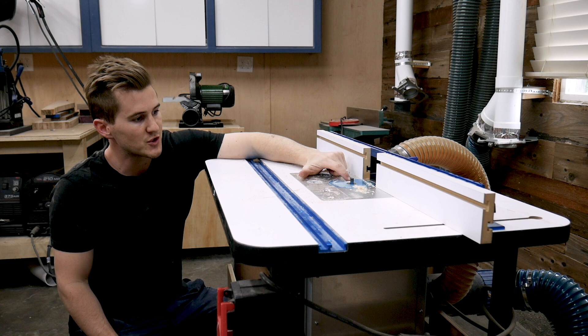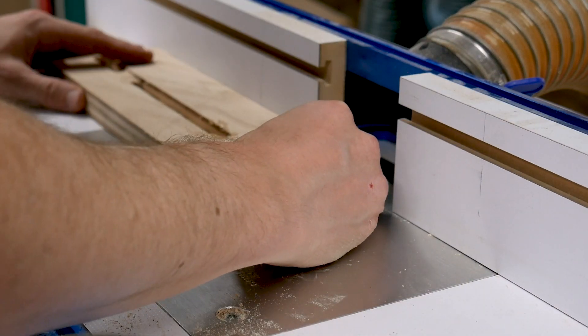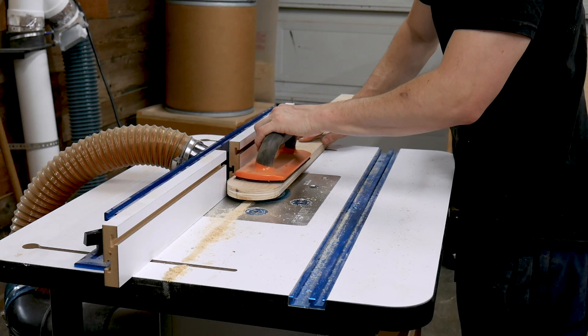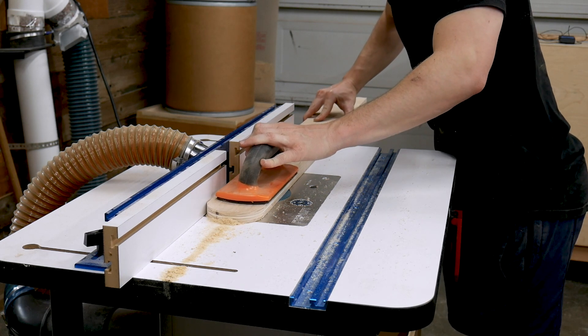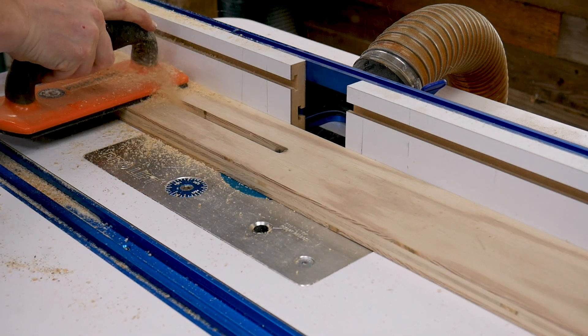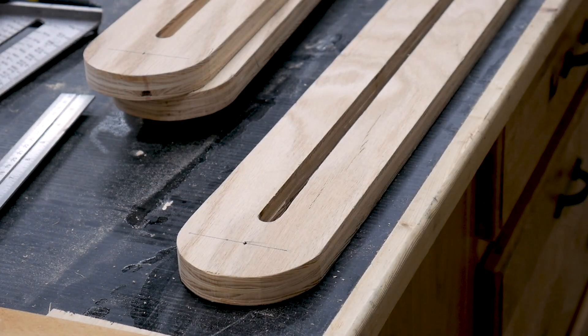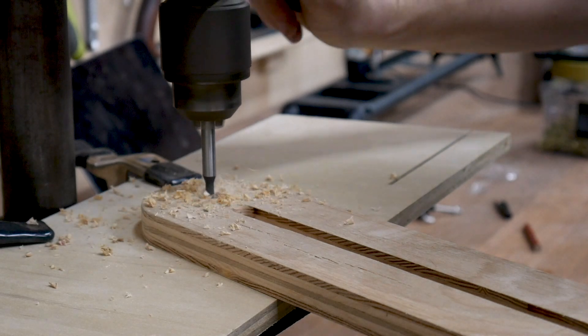What I did was put a half-inch straight bit in my router and raise the bit from the underside just slightly over half the height of the piece of plywood. I'll set up the fence so that when I run the piece along, it cuts a groove directly down the middle. Then I can flip it over and run the same groove, giving me a channel that allows screws to slide up and down. Instead of routing one side and flipping to avoid unevenness, I just routed the first grooves, then raised the bit up another half inch and routed them again — that worked out perfectly. The last thing is to add a couple of holes so the carriage bolts can pass through — we'll do that at the drill press.